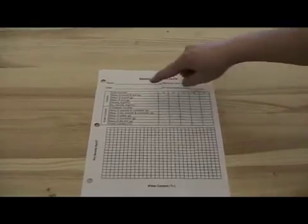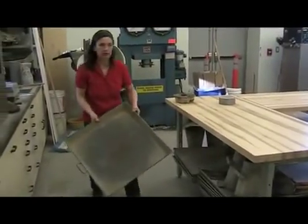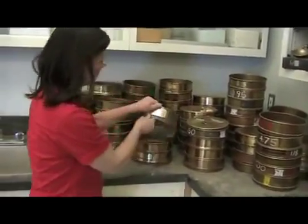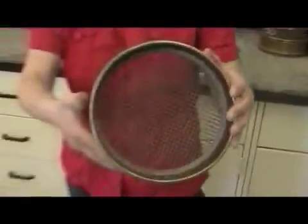For your testing, the first thing you want to do is put the label on it. This is a really long lab, so in the interest of getting it going quickly, start with two or three people in your lab group getting the soil and breaking it down into appropriate size. We're going to be using the trays from the concrete test to do our work to keep it all in one place. You'll need a number four sieve — this is a 4.75 mm sieve that you will be putting the soil through.